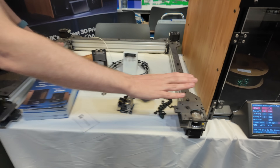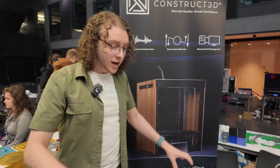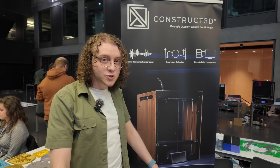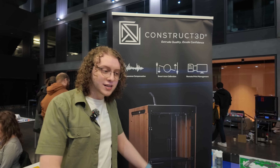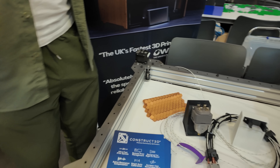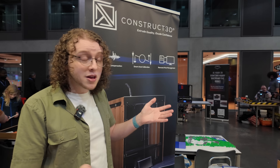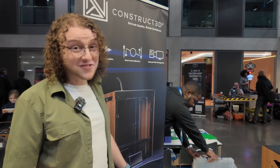For customers wanting custom sizes — 10mm smaller, 10mm bigger, or a meter difference — a scalable platform is in development using laser-cut steel, likely moving to aluminium to avoid bi-metallic issues. The square frame can be bolted together in different configurations with motors attached, creating a universal platform that scales without disrupting the manufacturing pipeline. Belt sizing may change for larger frames, but the core technology is already over-spec. It's essentially a template — laser cut a bigger frame and it just works.